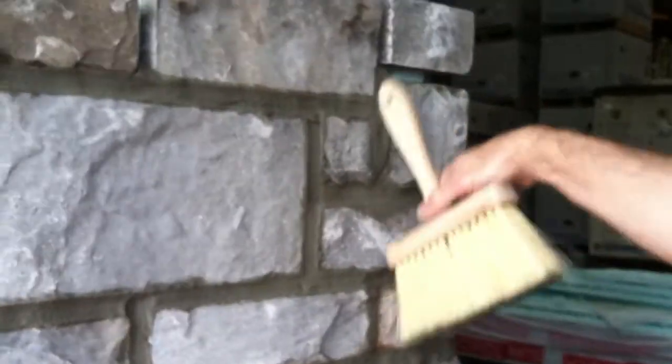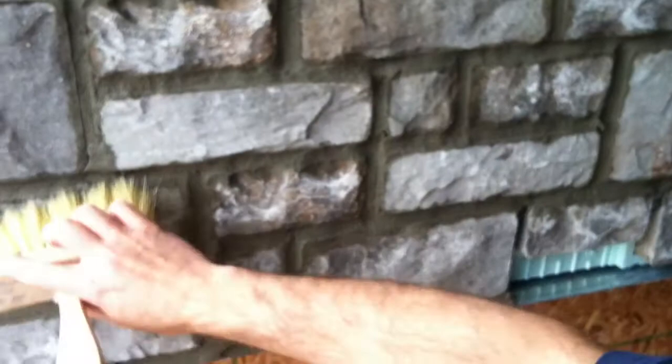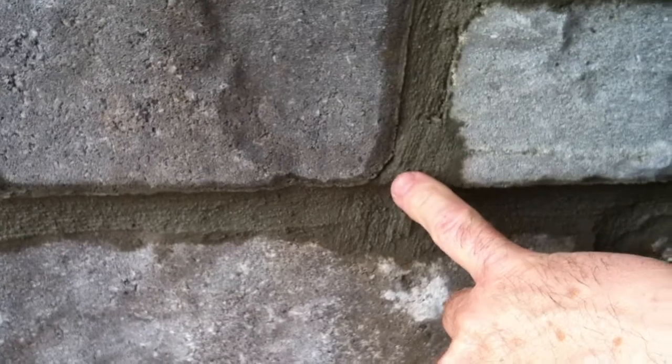I'm not going to brush that one too much. So this is kind of a purpley-brown stone — if I'm not being colorblind. What's the palette say? If it's purpley, it's going to be Margaux beige. So you could obviously adjust your mortar color to taste. We don't have color right now, but you could add it. Here's an example — the mortar's a little too wet. Actually, this is the joint that wasn't full all the way. When I brushed it, I put mortar in there and it's pulling away. It's Margaux beige — it has a little bit of purple in it. So that's it.